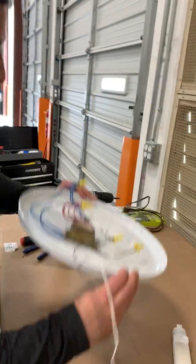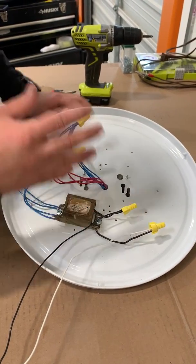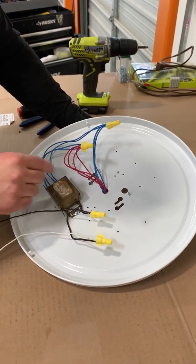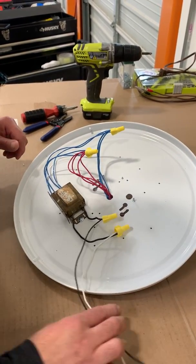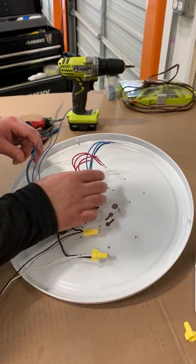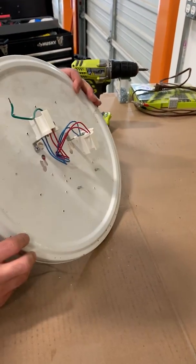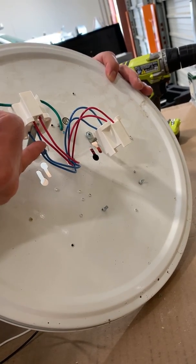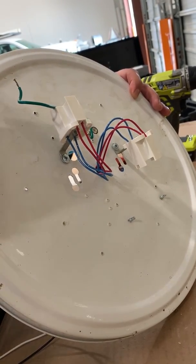Once you take the fixture down from the ceiling, this is what you're going to see on top. I have a mock-up ballast that I've wired up. The ballasts are going to be different per property, but it's basically the same thing. What you're going to do is cut the wires coming from the tombstones to the ballast. You're going to take those wires off — I've wire-nutted them here just to show you for this video. These are the wires coming off of the bases of the lamps. Keep in mind they should be color-coded — you should have two different color sets, a top color set and a bottom color set.